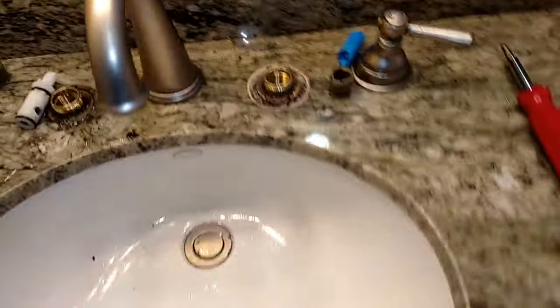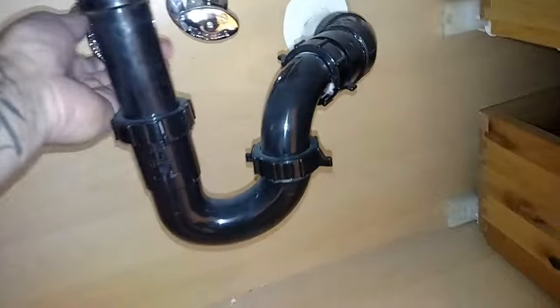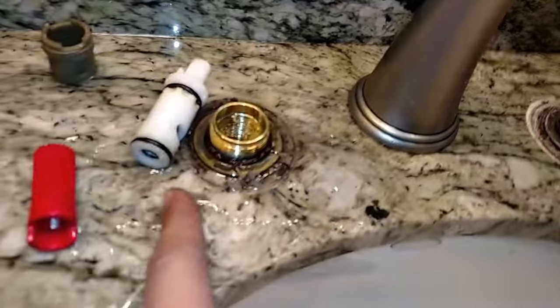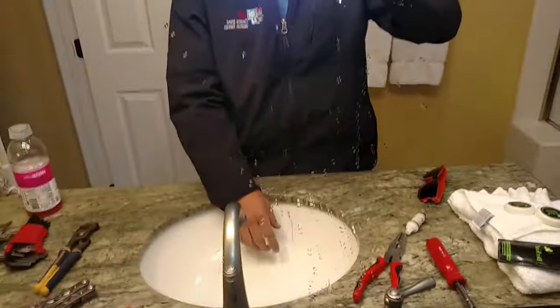Just make sure you shut off — you're not going to shut off the water at the main. Just make sure that your angle stops actually do work and you shut both of them off. If you just shut one, it's going to overflow on the other side and it's going to drip like that. That guy made a mess here. But shut off both of them and you won't have a problem. You might have a little gush, like that.